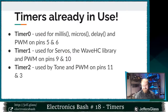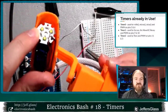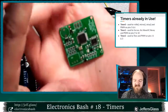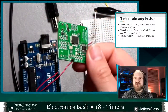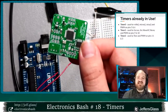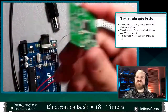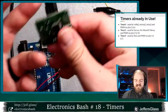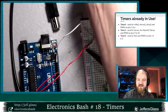I actually ran into this very recently. I'm sure you're sick of me talking about it, but I have this little tiny moving light project, which has been a lot of fun. It has some servos in it, and it uses pulse width modulation to dim an LED. That worked out fine, but then in the last revision, I put a little tiny indicator LED on the board and hooked it up to a digital pin on my ATmega328. It's probably useful to have a little extra indicator LED. Maybe when it gets signal in, the LED turns on, and when it loses signal, it turns off. It's just nice to have an LED on board that you can use to debug things. Or if I don't feel like hooking this up to the full external emitter, maybe I just want an onboard LED that I could dim to show me the status of the dimming without having to wire up the whole thing, right? Here's the goof.